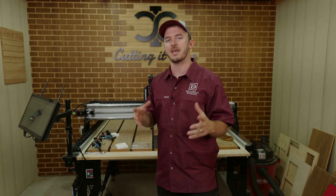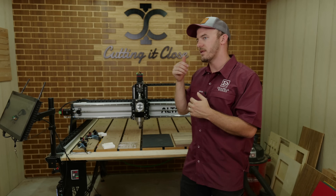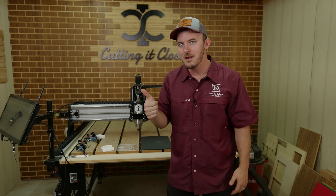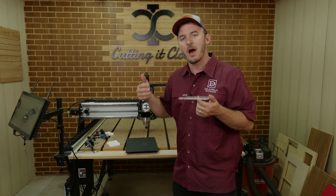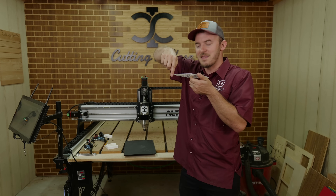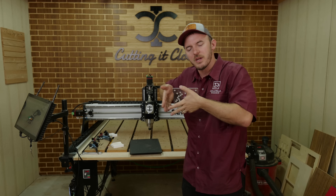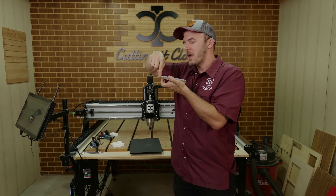The first couple of common mistakes people make when they start cutting plastic: they use a down-cut bit and they use standard woodworking bits. With a down-cut bit, the chips get in that groove — a down-cut bit puts everything into that trench, that cut path.